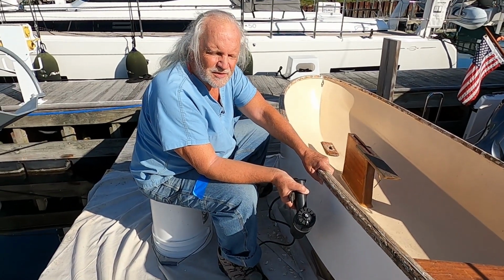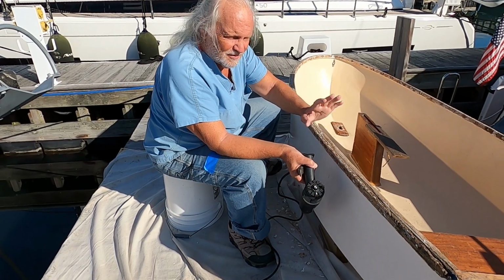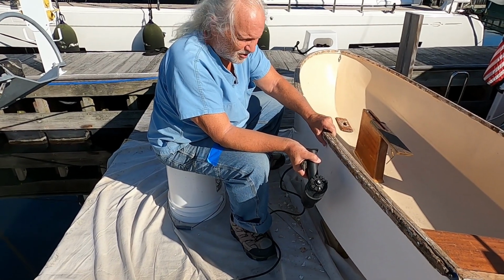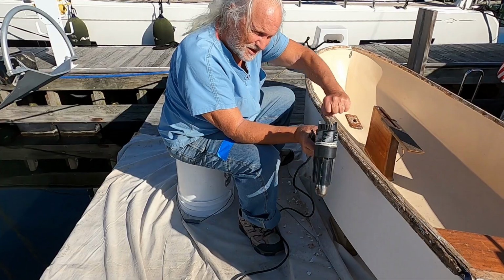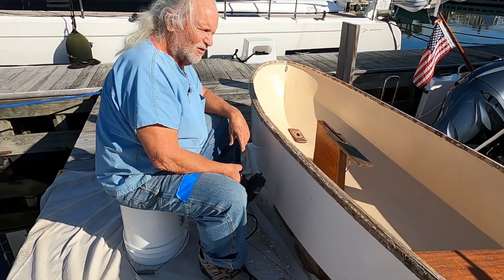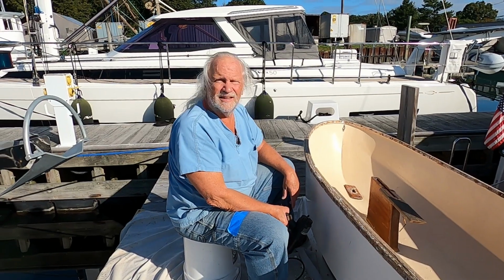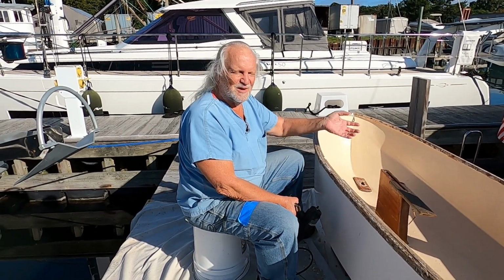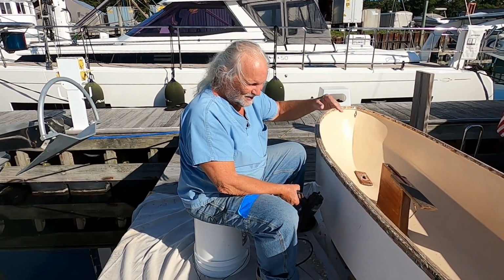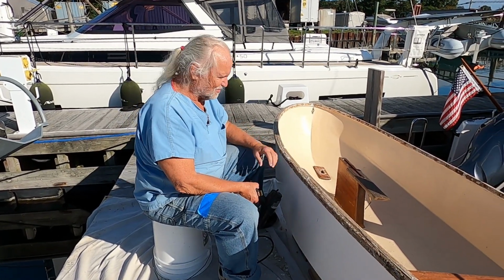What Dyer does is it gets white oak green. So somebody cuts down a tree, then they mill it, and then they steam bend it right away before it has a chance to dry out and harden. And then you have to use it within a month. Otherwise, it doesn't have enough give to make the tight turns in the front. And although I'd love to do it, it's a fun project, but we just don't have time. And they don't always have it in stock. Right. It's kind of, I'll cut down the tree, mill it, and then steam bend it, and then ship it to you maybe somewhere, sometime. That's the simplest explanation of what we're doing.